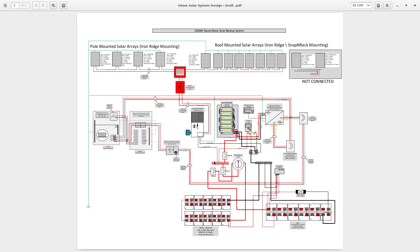My primary battery bank is a nickel-iron bank connected to the system with four-aught welding cable, capable of high amperage, but I limit it to 250 amps via a circuit breaker. The secondary battery bank is an AGM lead-acid bank connected with two-gauge wiring, so I limit it to 150 amps with a 150-amp circuit breaker — hence the two distinct breakers.